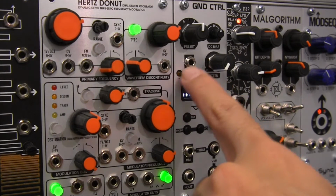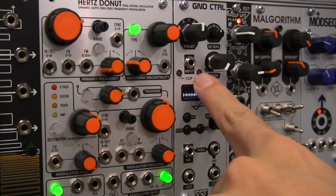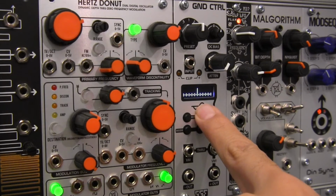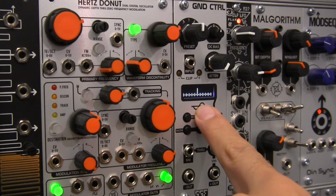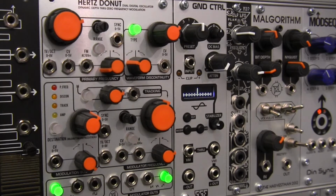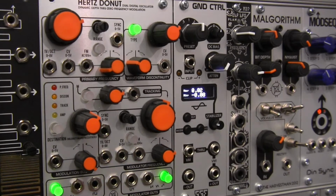The top input is tied to the attenuation and bias controls and has two clipping LEDs right there to see when your signal is too hot. There is an OLED display here in the center which will provide a more precise readout of your signal. The display runs in one of two modes: analog, complete with a virtual needle, and digital with a numeric display.